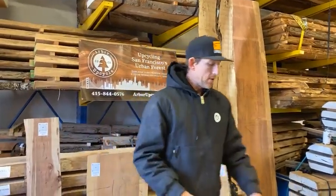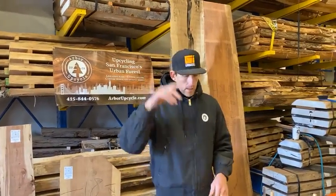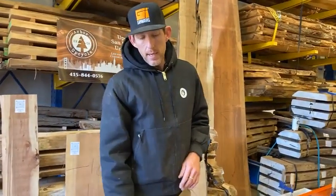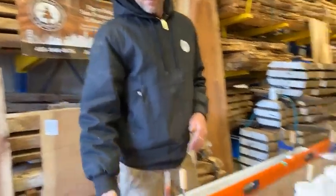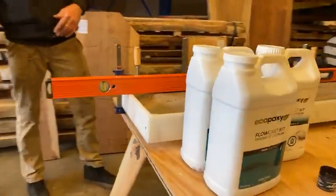But you're going to be able to reuse this over and over and over, whereas the melamine, once you start screwing it together, you're screwing it to particle board. You're only going to do it a few times, and then the piece, you can't use it anymore. The other thing you have to do with melamine is coat the whole thing with sheeting tape. This is a pain. You don't want to sit there for an hour putting tape on something, and in the end you're going to get all these lines in it. So you can use both, but for my suggestion, I always say HDPE. It's a better material to use. It's going to give you a longer life, and it's going to give you a better product in the end.